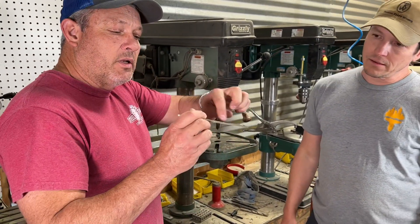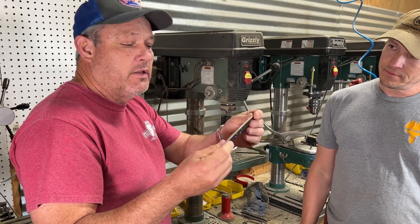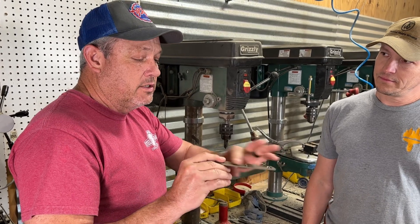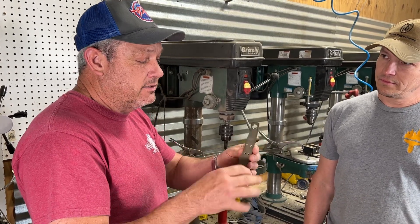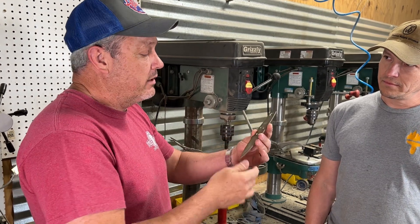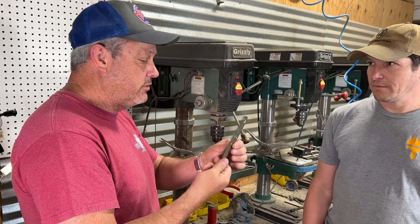As you drill, it whips up a little ring of steel around there. Some people will sand that off and just try to get their scale or their blade flat. But this makes it flat. And like Andy says, it creates a little ramp. When you're tapping that pin through, that little chamfered edge will guide your pin right in. So that's the first thing we use it for.